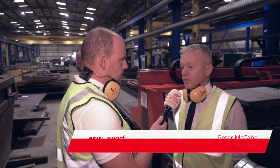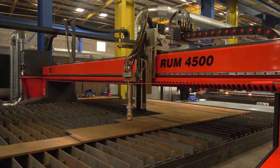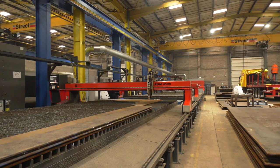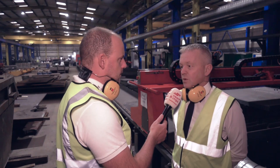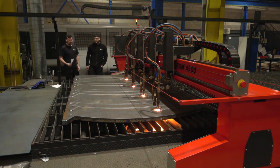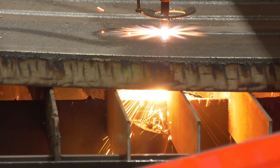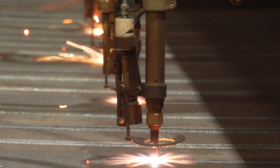It's a lot to do with the size of components you're cutting. For instance, at 30mm thick across the board, if we're cutting a plate that's say 6 meter by 1800, we would plasma cut it because the large area is produced a lot quicker. However, if the requirement were 60mm by 30mm, we'd put it on the flame because you get a squarer, cleaner cut — on profiles that size the machine's moving so fast they tend to tip into the torch and cause damage.